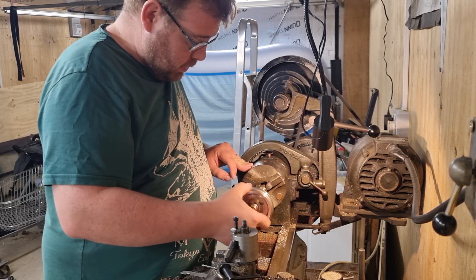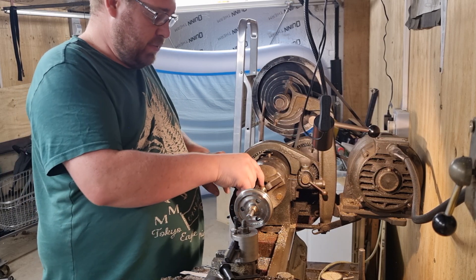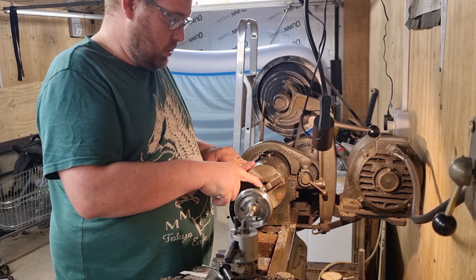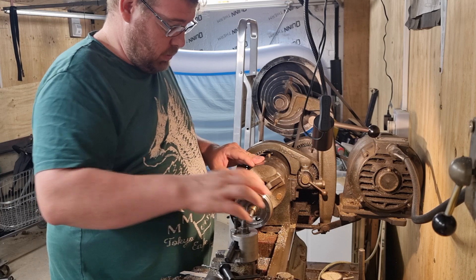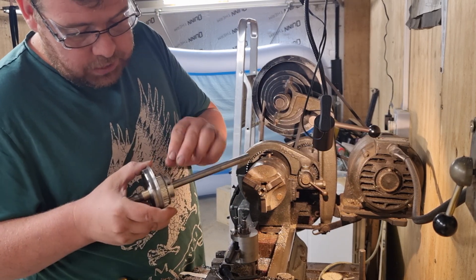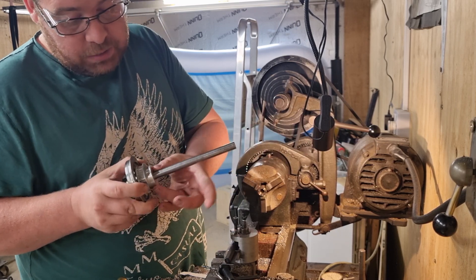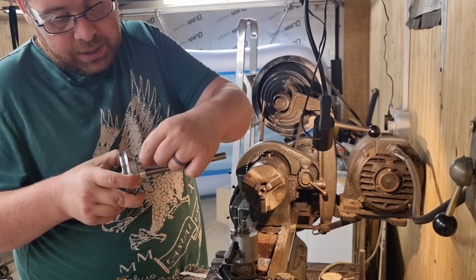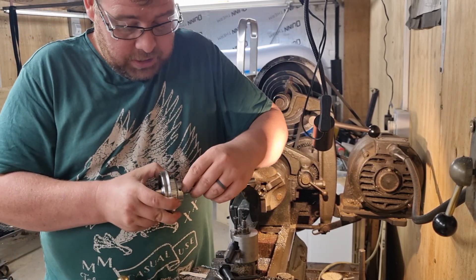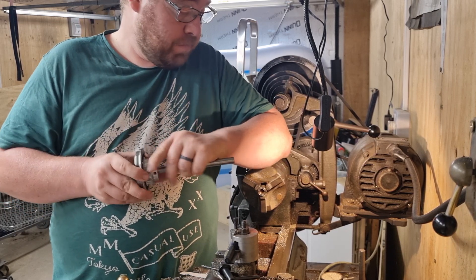I've machined this bushing just over half inch so the shaft slides nicely on there, because it's going to have a drilled and tapped hole with a grub screw - possibly quarter 20 or maybe eight mil, something like that. Just one in there. What I did with these is I set the gauge of this wheel, I bored those out to half inch, then drilled into there to put a divot in there so I can nip the grub screws up.